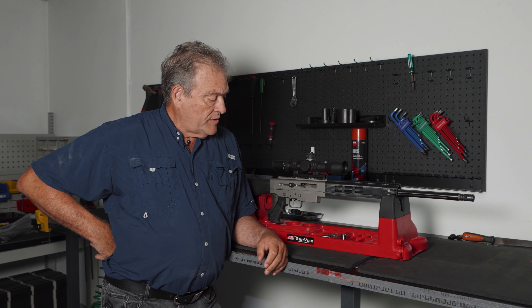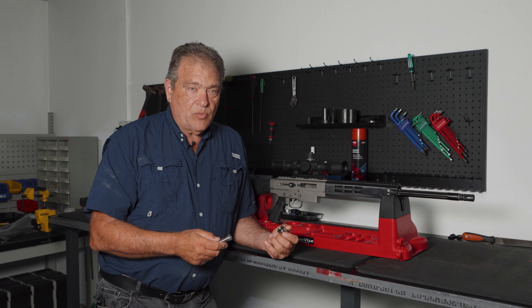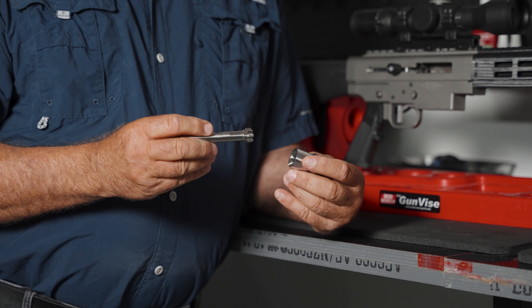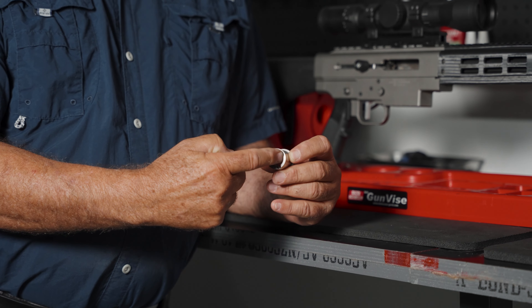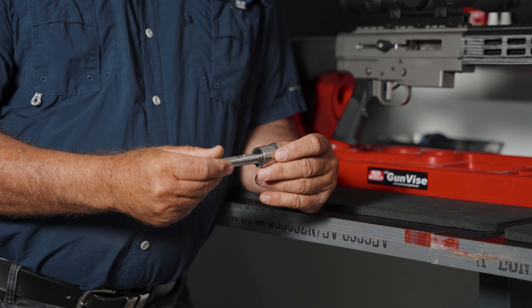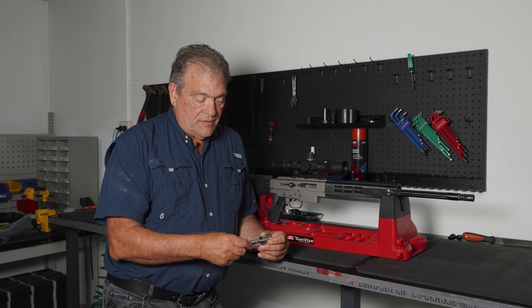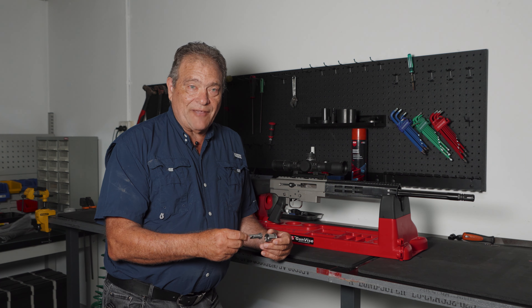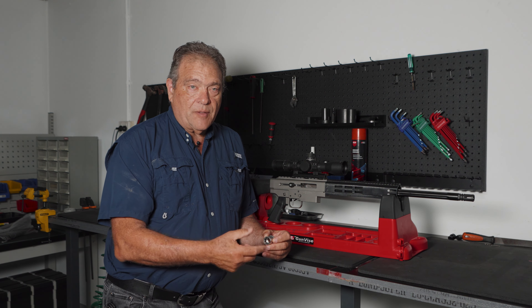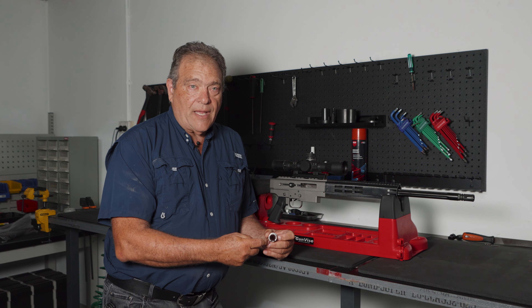The first thing I want to deal with is the bolt and the barrel extension. Something we knew but didn't actually adopt was that our bolt is actually traveling and locking inside the lugs. The lugs are going in and we've had it turning to the right to lock. But the reality is that all Armalite rifle style rifles — the bolts lock to the left. These barrel extensions are actually chamfered for the bolt to go into the left, to allow for a much smoother lockup and extraction.